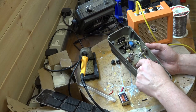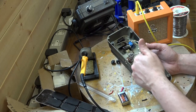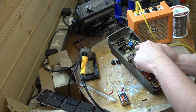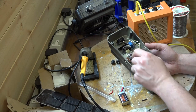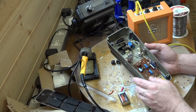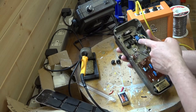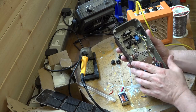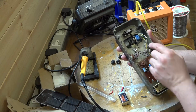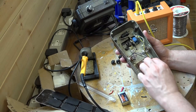Inside we've got two transistors and basically a filter circuit — there's our inductor. The signal comes in, goes through the filter, then via a buffer; the pot adjusts the level of EQ, and then it goes through an output stage. Looking at it, I'm not sure, but this pot looks like it might not be original — it looks like it's been rewired, and these wires don't look like they've been professionally installed.